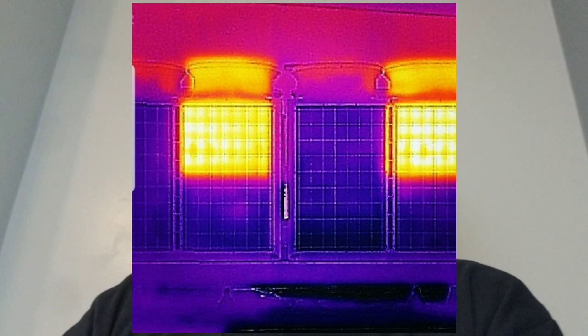In that first video, I went over just the basic characteristics of the outdoor equipment. Number one, this is based on heat pump technology — namely, it's refrigeration-based. It's going to run in heating as well as cooling modes. In heating mode, it will build frost and will need to defrost in the winter. Second, it's going to have variable capacity, meaning a variable speed compressor or multiple variable speed compressors. It will have variable speed fans, and it will also have variable capacity coils outside. Accumulators and receivers, which ties back to the variable capacity, will hold additional refrigerant that's not used during partial load.